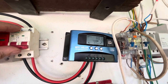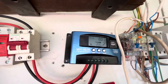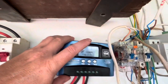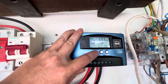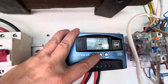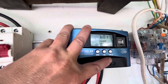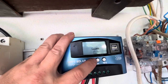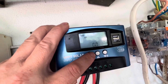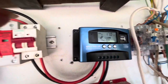Sticking the battery on first — 24 volts, already pre-programmed. Switching it on: straight away 17 amps. You'll see the 29.2 volt setting there. All the other voltages are for the outlet. I've selected BO1, battery type lithium.